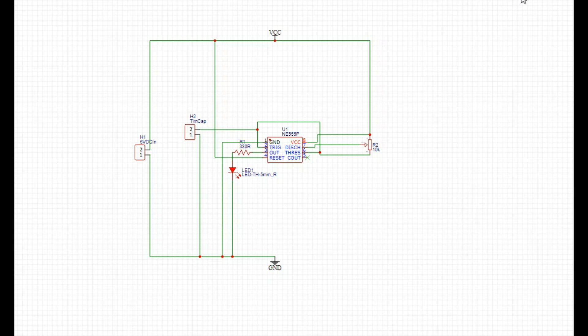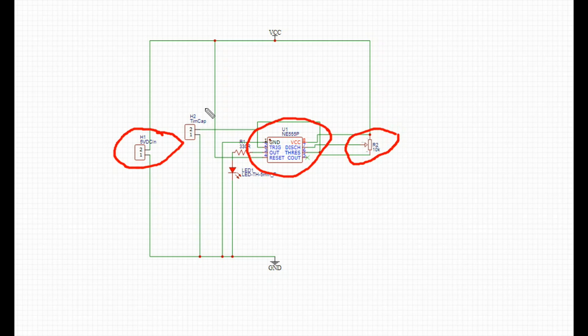Today what we're going to talk about is a simple 555 timer in astable multivibrator mode. Basically it's an oscillator — it's going to turn an LED on and off. It's not a difficult circuit at all. We have our power coming in hooking into our power board, the 555 timer, a potentiometer to control the mark space ratio, and a female header to change out the timing capacitors, because variable capacitors that cover a large range are not available. Then we have an LED to blink on and off, and that's really all there is to this.